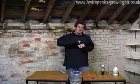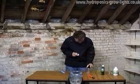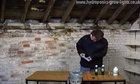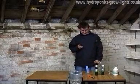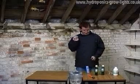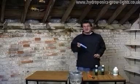We'll do that for you right now just to show you how easy it is. So pour a little bit in the glass. Get your TDS meter, pop it in. And this is actually showing me a reading of 27, so I don't need to do any adjustment. But if you did, just stick the screwdriver in the back and turn it one way or the other to compensate. And that's basically how you simply calibrate meters.